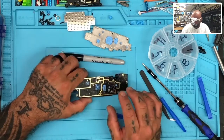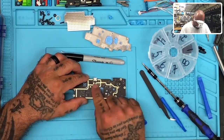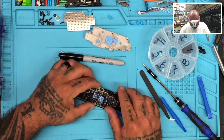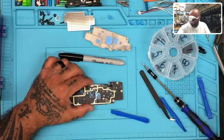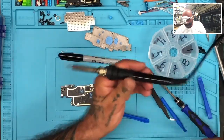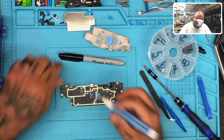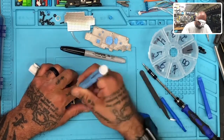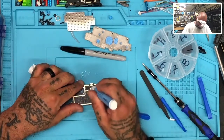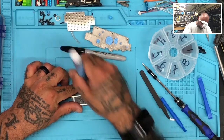Make sure to be careful because you've got a bunch of thermal paste right there. It took all that for this little piece — our USB replacement. Now we've got to get this off, and that's going to be a task on its own. There are going to be five pins that we're going to have to desolder. We're going to do our best to heat this up without damaging the other components. I've got my soldering iron super hot and I've got the fine tip on it. I'm going to get my flux pen and soak the crap out of this thing.